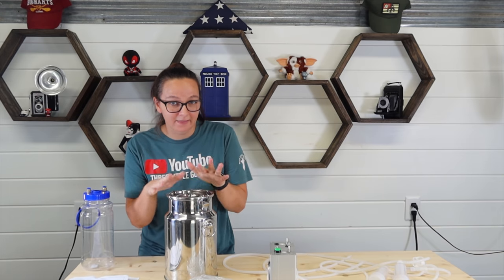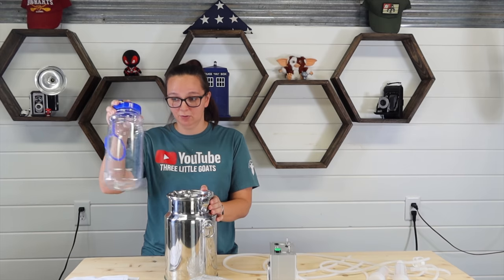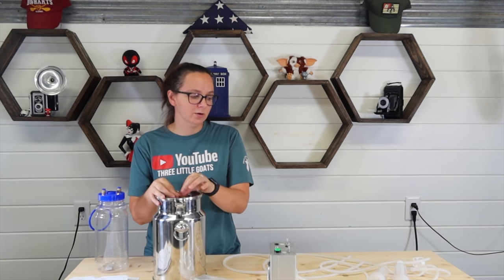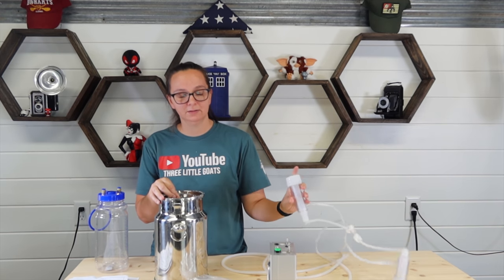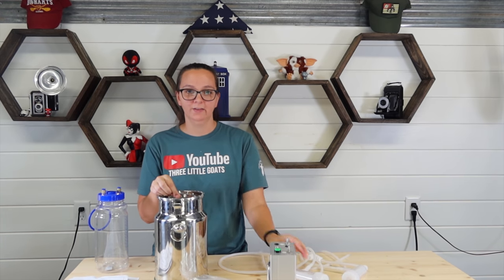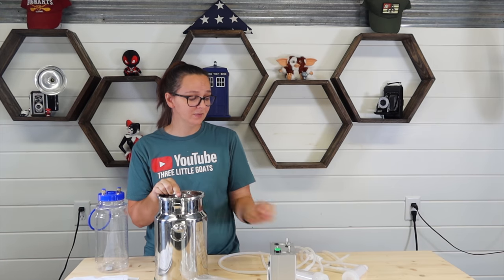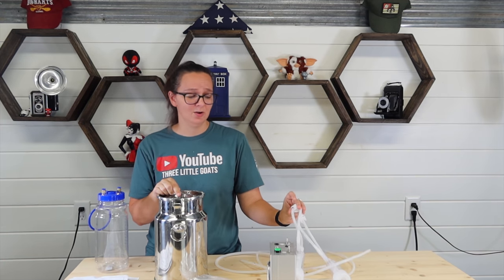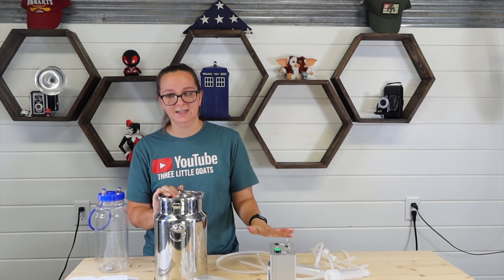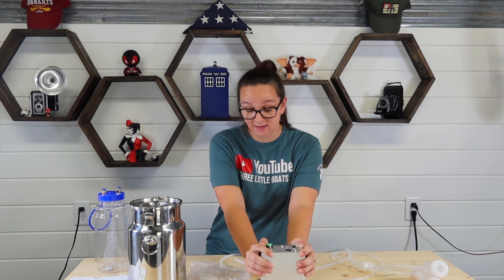One thing I don't like about this bucket: it's too big for me right now, which is why I downgraded to a smaller bucket. In order to release the teat cups from your goat, you have to clamp the hose and then release the pressure from the valve, and those clamps are very hard to get off. While they do a good job at crimping the hose, they don't crimp it completely, so it was kind of hard to pull them off to get the teat cups safely off the goats.